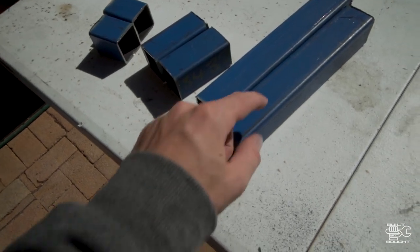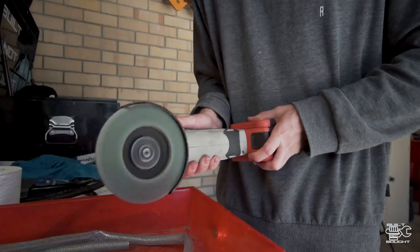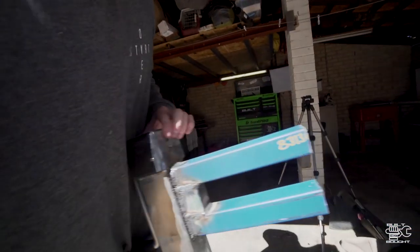It's time for welding. To weld this, I want to first clean up all these ends — grind the edges off all the burrs, and also grind the side because when it's welded I'm going to run a bead down the side. Anywhere you're going to be welding, get rid of the paint and grind it back. I put an Instagram poll up about canola spray versus anti-splatter spray — it'll stop the little spatter balls from sticking. I did the first one and noticed all these little balls were all over it. That's just MIG welding, so to deal with that, use anti-splatter spray — a cheap alternative is cooking oil spray because it stops it from sticking. So I'll put that on and then weld it up fully, get all the arms on there, and then test-fit it into the side of the canopy.